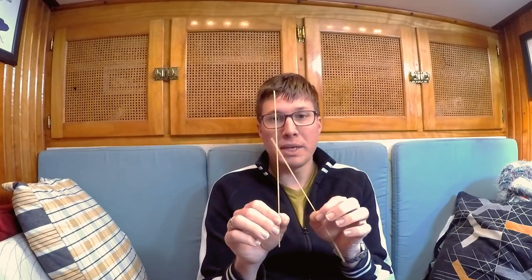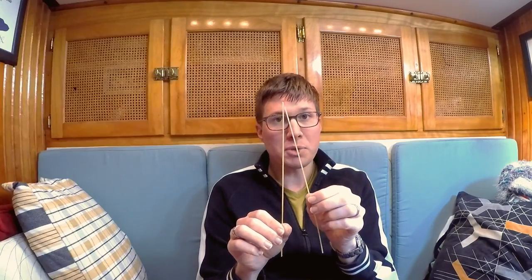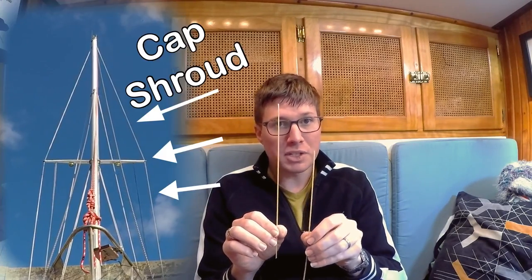From a basic engineering standpoint, the idea of a spreader is to simply increase the angle that a stay meets your mast. For example, your lowers — the stay will be at this angle coming up to meet it, but for your cap shrouds it's a much tighter angle. So the idea is if you can make the stay come up, reach the spreader, and then turn to go up, it increases the angle. The minimum angle you can have to be effective is twelve and a half degrees. Once you're past that point, a wider angle means the stay is more effective and everything works better.